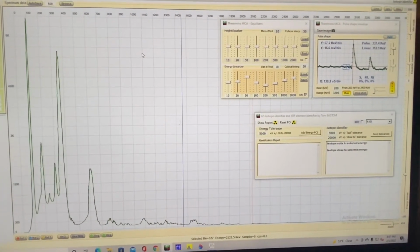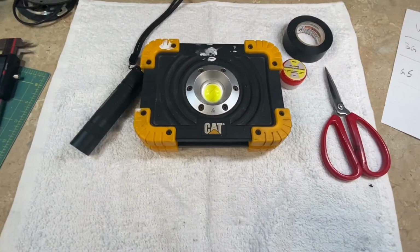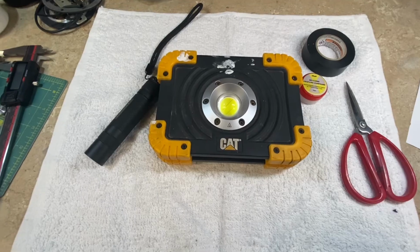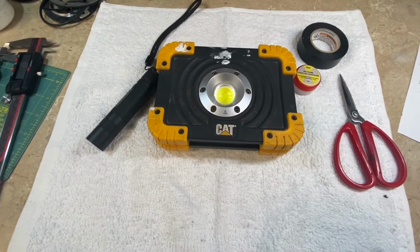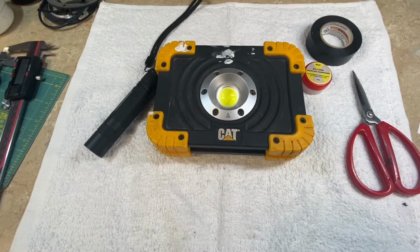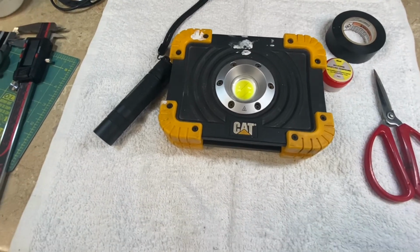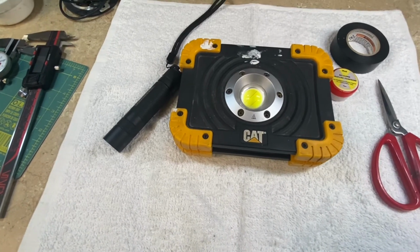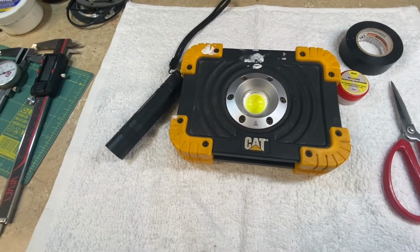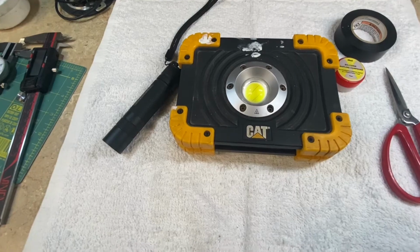So, all right, let's back out of here and examine what our differences are in the numbers. Okay, so the conclusion is this. Background before illumination was 3.6 pulses per second, and background after illumination and rewrapping was 3.8 pulses per second in 500 seconds, which made a grand difference of 0.2 pulses per second. The grand total in 500 seconds was 1,810 pulses, and the illuminated afterwards was 1,882, which made for a difference of 72 pulses.